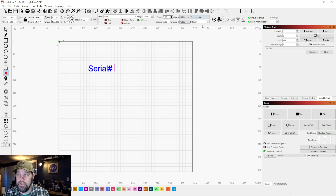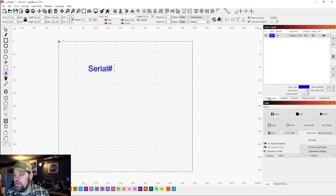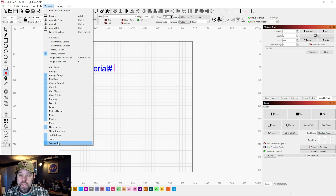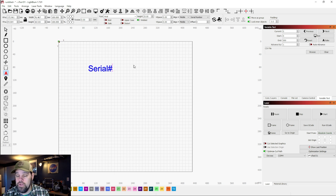We want to change the text type to serial number. Then we want to play around with the variable text, which should appear over here under your tabs. If you don't see it, go to your window menu and make sure variable text is checked. Once you have that in place, we can add some modifiers. The basic modifier is a lowercase 'd' — that tells Lightburn you want a decimal number. Over in variable text, set to current with a start of zero, it changes that 'd' to a zero.